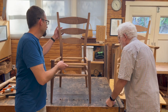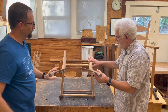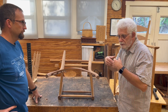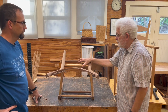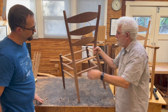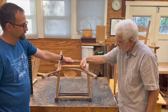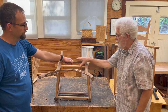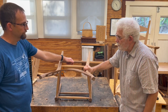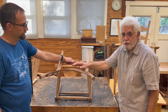You briefly mentioned the angle of rotation of the back leg because you have this back assembly — we'll cover that as well. In the demo, we only accounted for the splay angle when we drilled for the rear legs — we were just describing the principle of the angles. We did not account for the rotation of the rear legs, which has to match the rotation where the slats meet the rear legs. But it doesn't affect the drilling angle — that stays the same, the jig stays the same. We just have a process for, once the legs are held at the correct angle, rotating them into position so they'll match the angled slats.